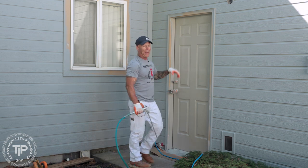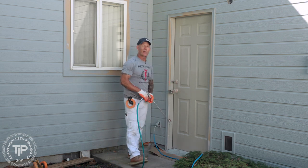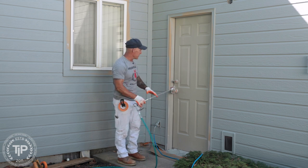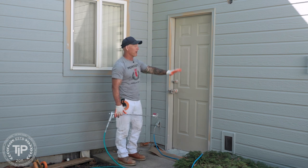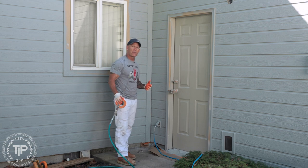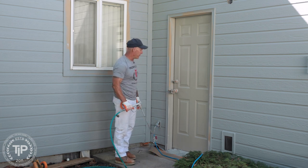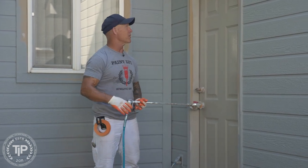If you're painting a door that's really smooth and brand new, it's critical that you don't get lines or tailing edges — that would become a problem. This is an older door, it's been painted multiple times. I put it on heavy enough and it leveled out, but you've got to be really careful using a sprayer like that if you're looking for a very fine finish. It's just dropping pressure extremely fast.